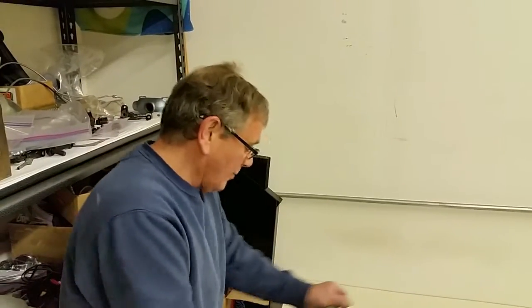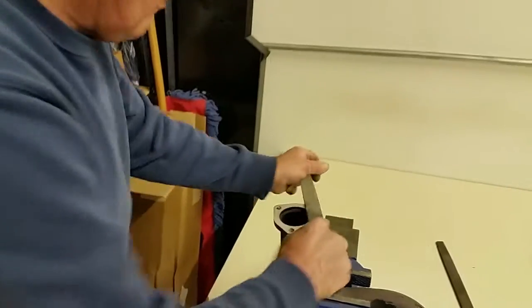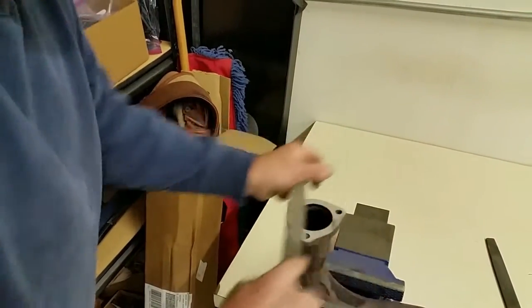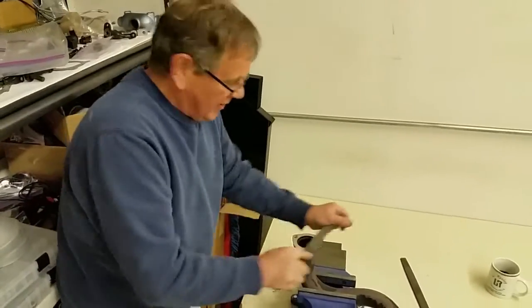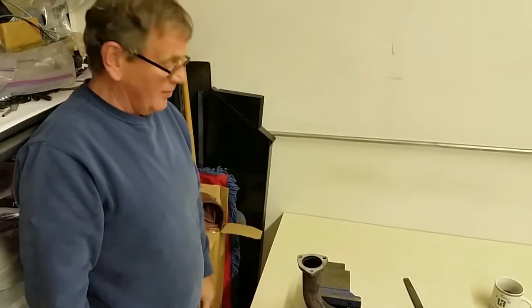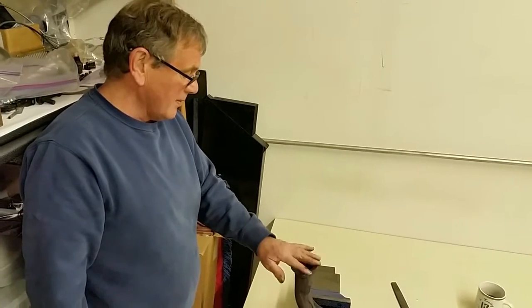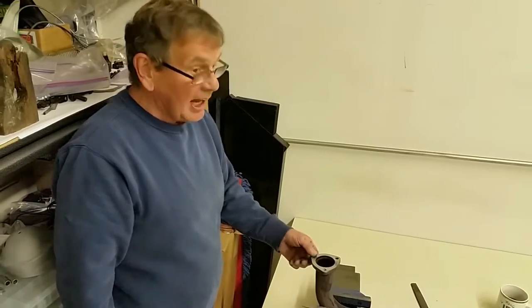It's now hopefully flattened so that we're beating the blowout blues that we were suffering earlier. So if you have a flange gasket that blows out, it's probably worth checking the flatness of the flange. Hopefully we've managed to lower all of the other part of the flange to get past the low spot there.